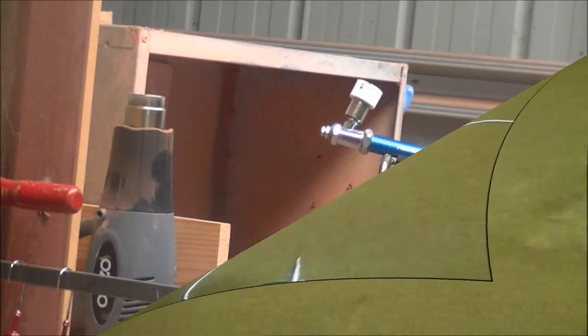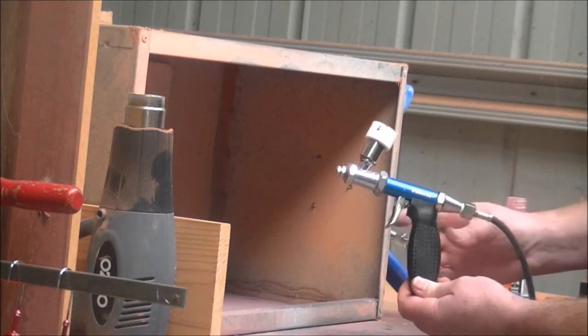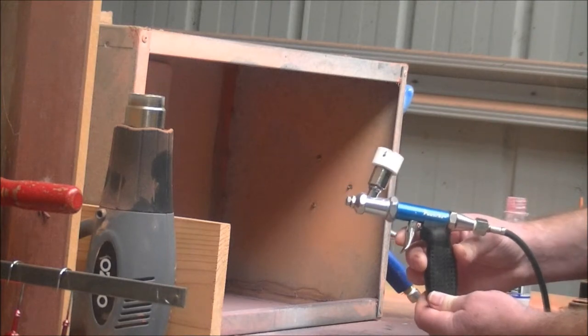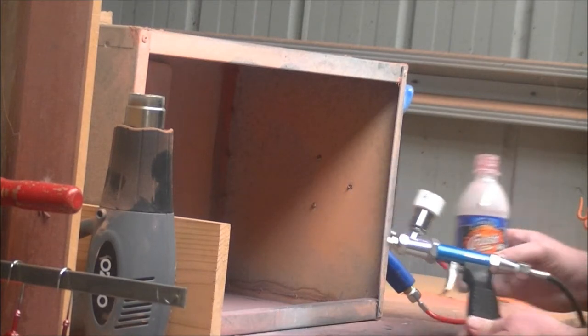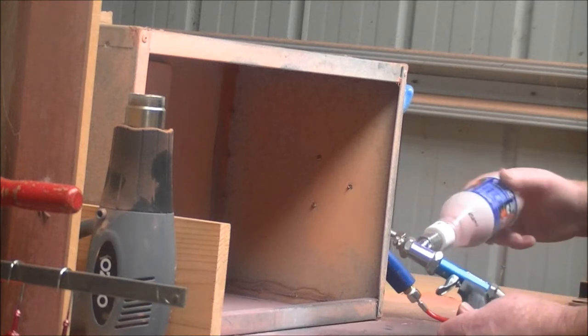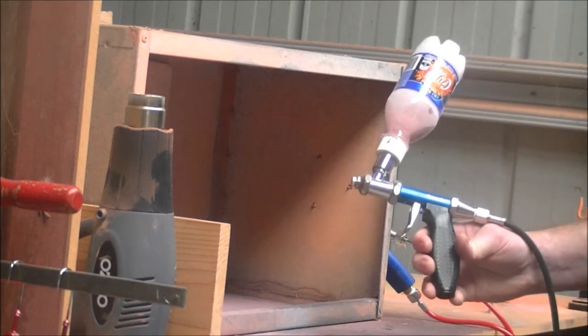Just going to run through the powder paint gun — that's our pro powder paint gun. Trigger control controls your flow of powder. You also adjust your PSI on your compressor to get the right flow. Basically, all you've got is a small lemonade bottle that fills up with powder, sits on top of the gun, and you screw it in. Ready to go.